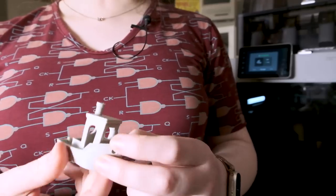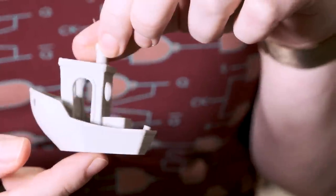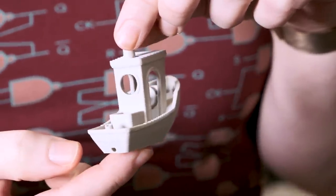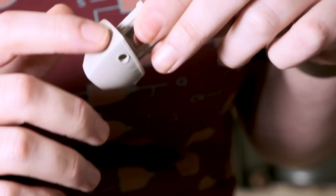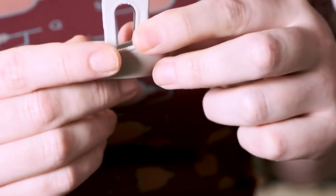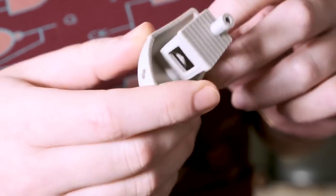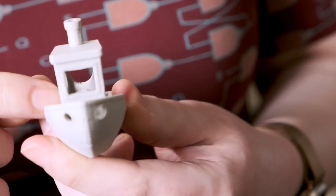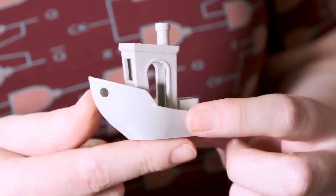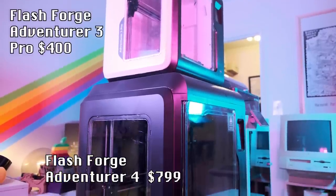We have a pretty good looking little Benchy for 24 minutes — just from unboxing this printer, getting it plugged in, putting in filament, and printing a very detailed model like this Benchy. There is a little bit of ringing around the circle, but I did put it on sport mode because I wanted to push this 3D printer a little more. The seams are awesome, there's no stringing, and there's no overhang issues whatsoever — just a little bit of drooping but it's really good. This would have taken an hour and a half to print on my CR-10 or my FlashForge Adventure 3 or 4.